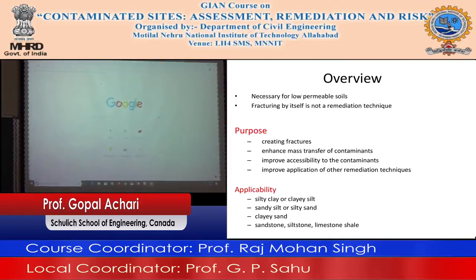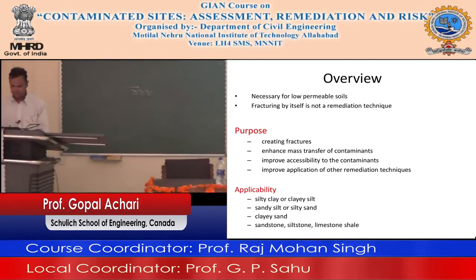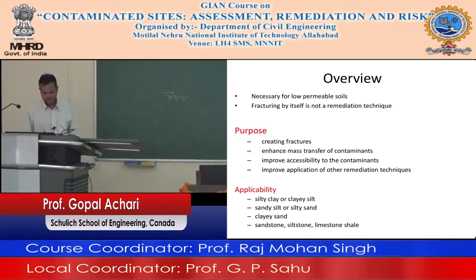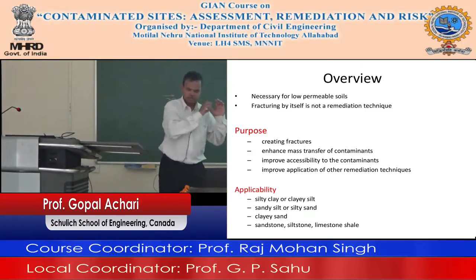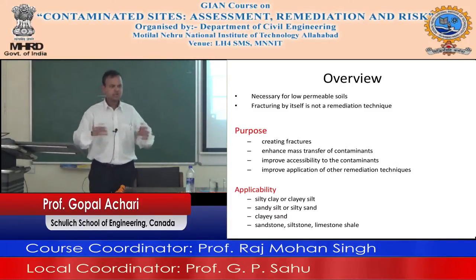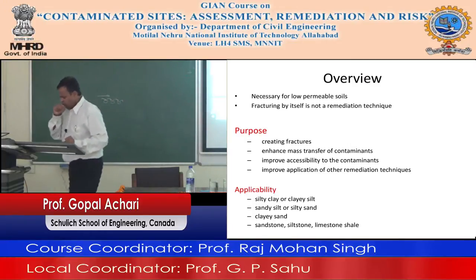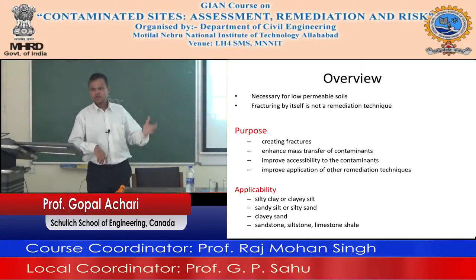So you see, this whole technology we have taken from the oil and gas industry. Basically, that in a nutshell is how it happens. You create the borehole, you case it, and then you put this thing that causes the blast, and then you continue to pull it back. Depending on what you want, you can either blast air, which is pneumatic, or you can blast water, which is hydraulic.